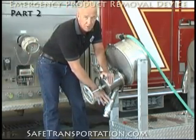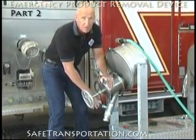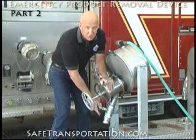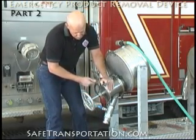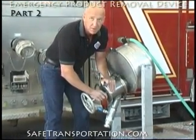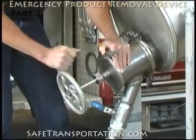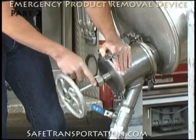When you see some emergency responders with this emergency product removal device, they may not have this ball valve — it may just be a cam lock fitting, so as soon as they release the product, the pumping process has to begin immediately. The ball valve is great for training and gives you another point of control. As you can see here, we've developed a small leak coming from a packing nut that you see me tightening right here. It will be very tiny — all you need to do is turn it with your hand until it's tight enough to stop the leak. The packing in there is to prevent any product from leaking down on the stem itself.